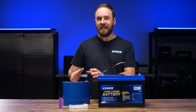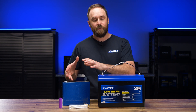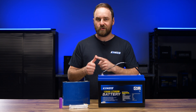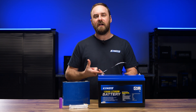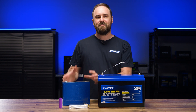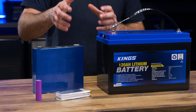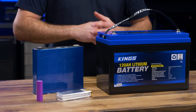If you're looking for rugged and durable cells with minimal connection points, therefore minimal potential failure points, good energy density, good power to weight ratio, and good thermal management, then you've got to look at prismatic cells. Now that's not to say that cylindrical and pouch cells don't have their place, depending on the application.